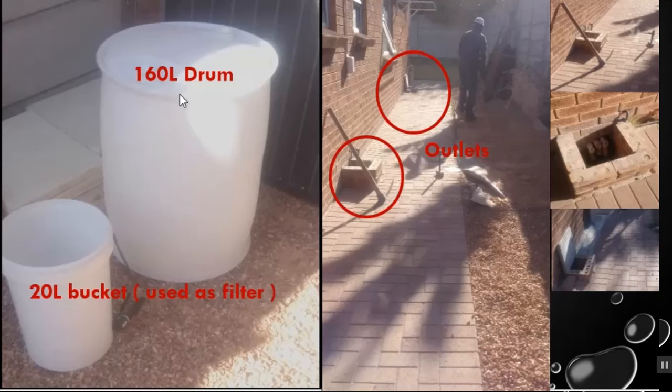From our plan we can see we have a filter and a tank. We've taken a 160-litre drum to serve as our tank. The reason it's fairly small is that you do not want to keep grey water for longer than 24 hours due to generating odors and growing bacteria. On the middle side are our outlets circled where we want to tap into, and on the far right are close-ups of what that looks like. A 40mm irrigation pipe fits quite nicely over those actual outlets.